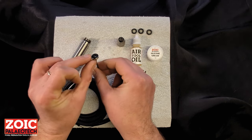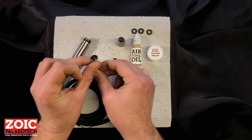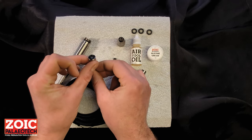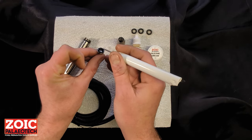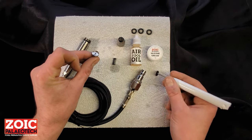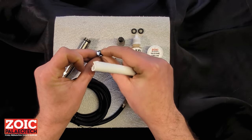Also check the state of the o-ring. If you find that a flat has been worn on top of the o-ring, it means it is no longer performing a proper seal, allowing the cycle to start. At that point, you will need to replace the pusher plate o-ring — just take it out and use one of the ones that comes in the pack.